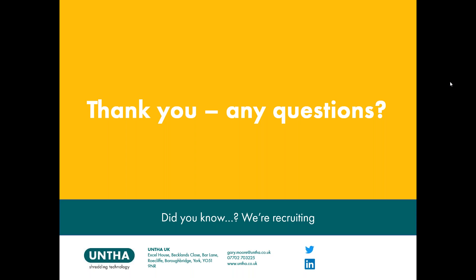UNTHA Genius was mentioned — is the data available in Genius to benefit the operator, or can UNTHA's own engineers use that data as well? Absolutely — Genius is there to benefit the owner and the operators. Our own engineers and service and maintenance teams also have access to that information. With Genius, you can dial in to look at what your machine is doing on your laptop, mobile phone, or any other media-bearing device. You can see what the machine is doing, monitor rotor speed, oil temperatures, and analyse exactly what's going on with that machine. Fully available to all customers, and equally available to our own engineering teams.